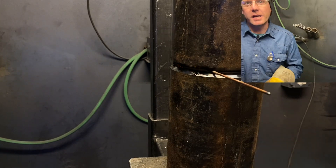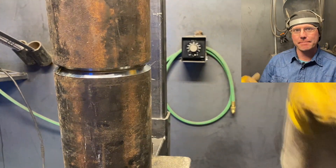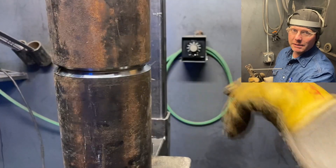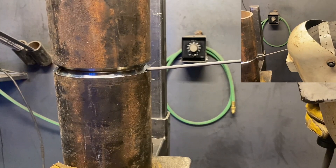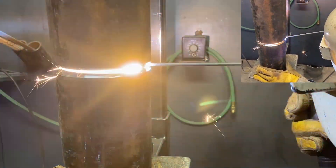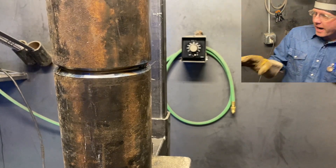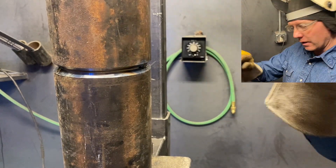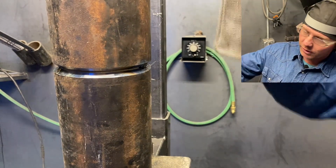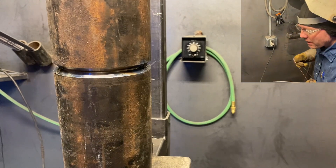We want to put about an inch, maybe an inch and a half tack in there so nothing moves around while we're trying to set up our fit. It has a tendency to open up on the opposite side of the tack. Pull your spacing wire out, pull that gap back down to where you want it — roughly the 3/32. Tack directly opposite of that first tack, and we'll tack another one wherever the gap seems correct. I always tack in the same direction if at all possible, starting from left to right — that tends to even that gap out. It pulls one way when you tack one direction, then when you do that opposite it pulls everything back to where it needs to be. I'll check that gap one more time with my spacing wire to make sure everything's nice and even.